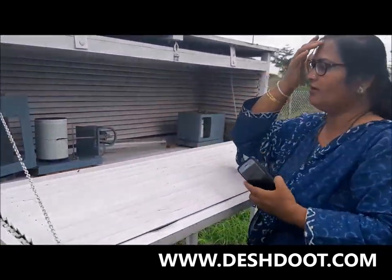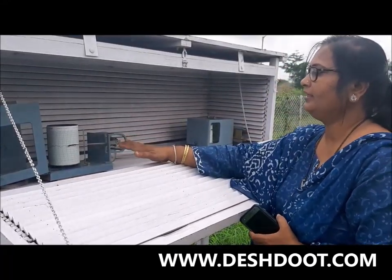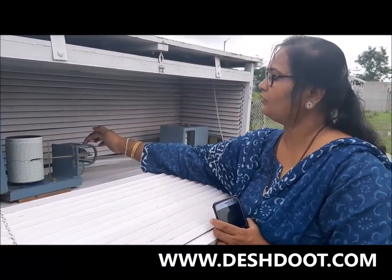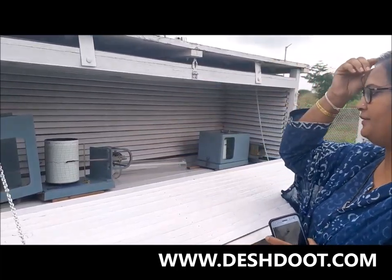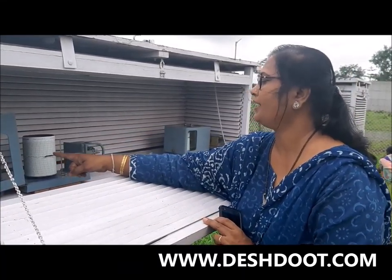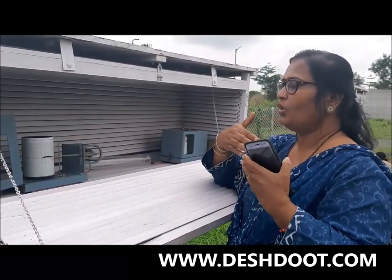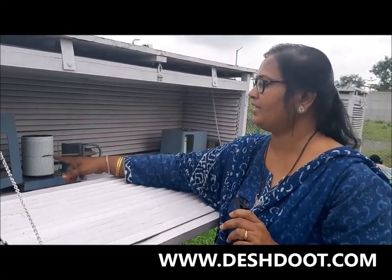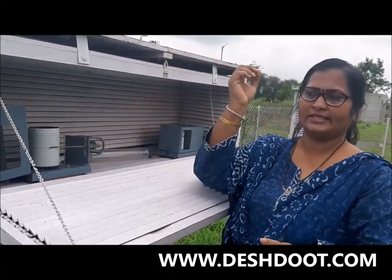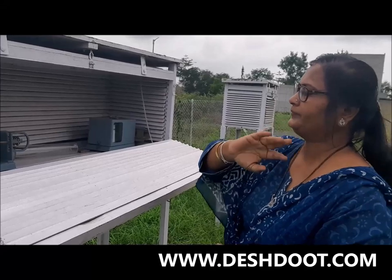Here is a thermograph — this is the temperature recording meter. Here is a bimetallic spring. This spring is fixed at one end and the other end is the pen. If there is a change in temperature, the spring expands or contracts and moves the pen. We can get readings over 24 hours. We can get observations from the 8th hour onwards, and get the rest of the day every day.